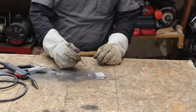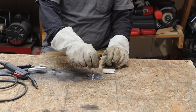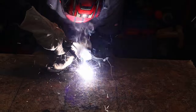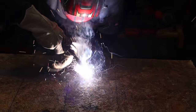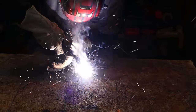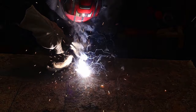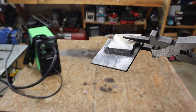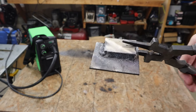You can do stainless steel, and you can actually do a stainless-to-steel combo — most people don't know that. You can actually weld those two metals together. You'll run into corrosion-type issues, but if you've got a crazy odd job where you need to mix those two metals, it can be done.